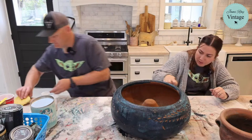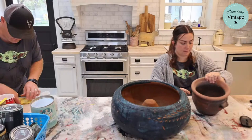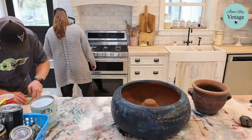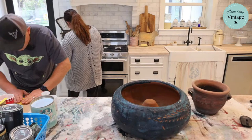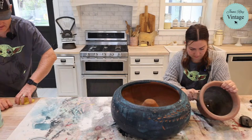Corey says she's excited for the church and wants to fast forward. We want to fast forward too because right now it's not a lot of fun stuff — it'll be fun once we start filling it, but until then it's a lot of work. I'm probably going to rebuild the stairs back up today this afternoon so I can get the plaster out of upstairs. Then I've got to rebuild some stairs up to the stage, rebuild that front wall, rip some carpet out up above, and repair termite damage — cut out some drywall that got some termites in it.